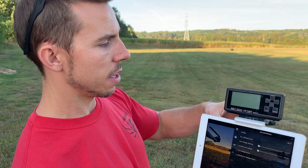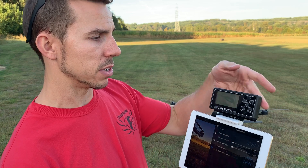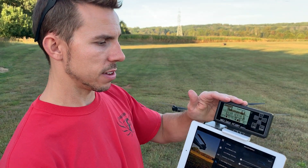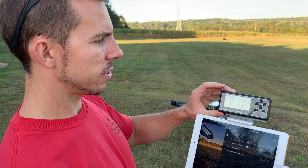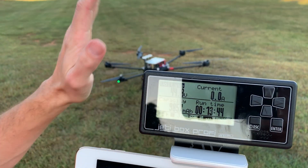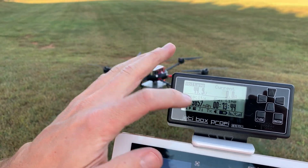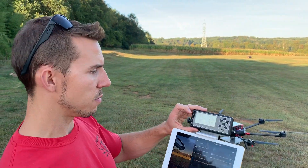It comes with a little plate that we just Velcro right to the back of the Lightbridge 2 radio. To turn it on, just press and hold. Basically what it's going to do is give us four readings throughout flight: voltage, capacity, current, and runtime — all in real time. It's already set up; all you have to do is turn it on. I've already flown 13 minutes with this aircraft, which is why you see these current values here.